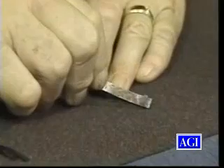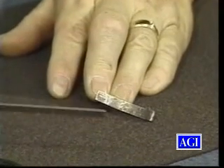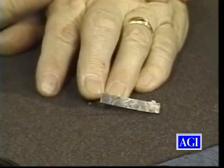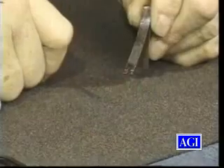On many springs, they're going to have a little nubbin sticking out that helps to hold it in place, and this spring is no exception. You notice that right here you have a little tail sticking out that goes into a hole in the frame, and positions the rear of the spring a little bit so it won't get away from you. The front end here is held by, in this case, the hammer stirrup.